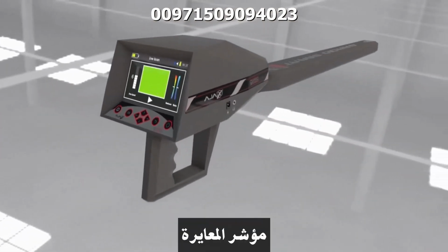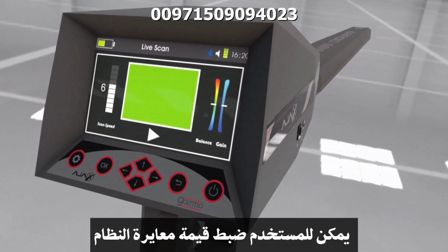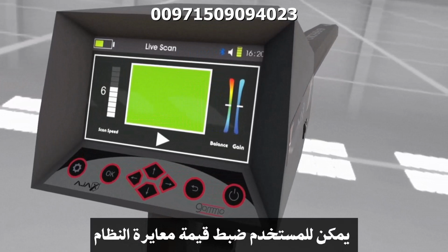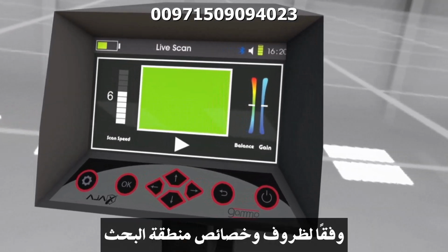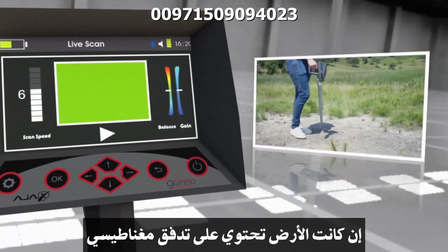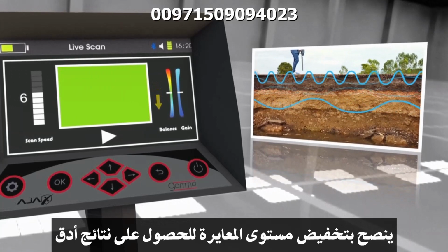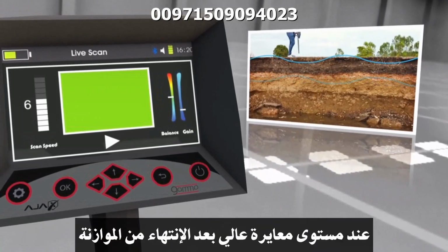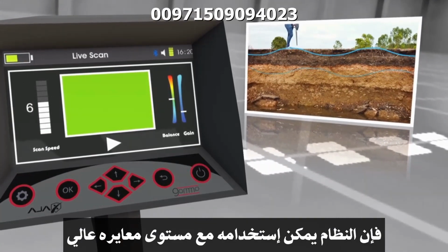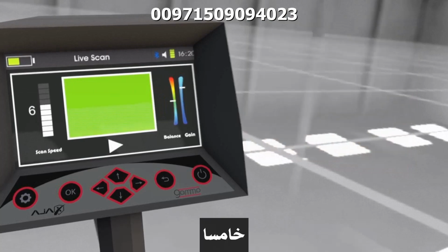D. Gain indicator. If the GradioSmart sensor is connected, the user can adjust the system gain intensity according to the conditions and features of the scan area. If the ground has a higher magnetic flux, it's recommended to lower the gain level to get accurate results. If the system is stable at a high gain level after completing the balance, then the system can be used with higher gain levels.